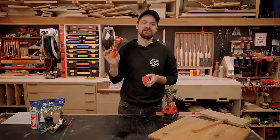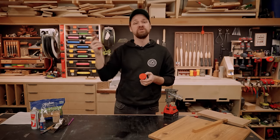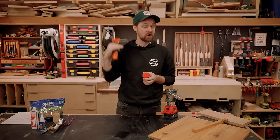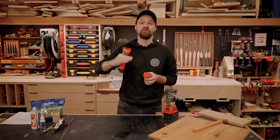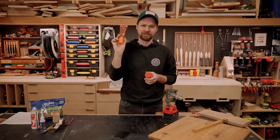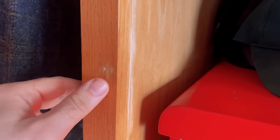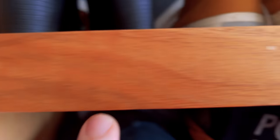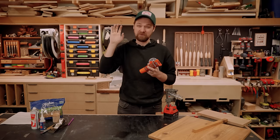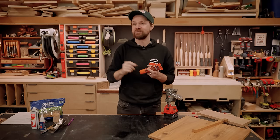Now you can see all those little spots that you filled in. One thing to keep in mind when picking wood fillers is color. A lot of wood changes color over time if exposed to UV — most wood goes darker, but woods like walnut actually go lighter. Do a little research, because the filler is going to stick out like a sore thumb when it no longer matches. I have furniture made of red oak where I used a maple filler and now you can see every single fill mark.